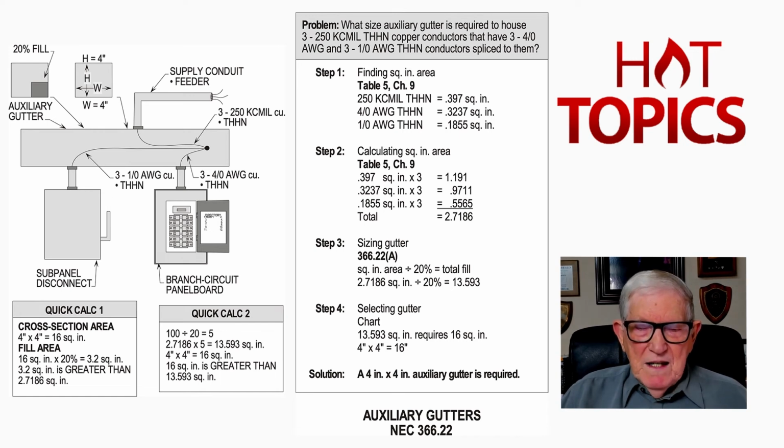Now notice B, as in boy, bare conductors. So you can tap from bare conductors, but that would be those conductors like that bus bar that you size in 366.23. For example, say that you had a quarter inch thick bus bar and it was copper, then that'd be a quarter times 1,000. That's how many amps you could put on it, see? Length wouldn't have any difference. If it was half inch, then you could take a half inch by 4 times 1,000, as you see listed and the permission given in 366.23(A).